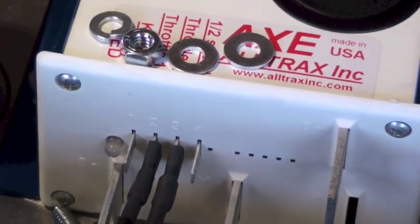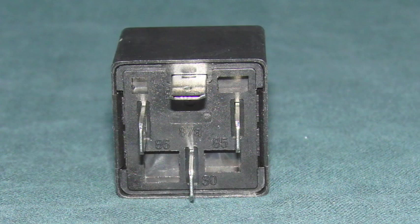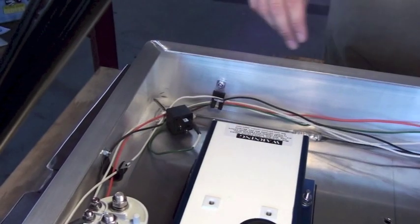The final green wire in the corner of the box goes to reverse relay position number 85. Looking closely at the relay, all positions are numbered around the four tabs. Position 87A would be for a center terminal post not present on this relay — this relay has four spades, not five. Position 87 is shadowed by the spade itself so the number isn't visible, but it is there underneath the top terminal.